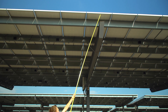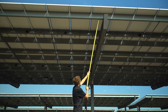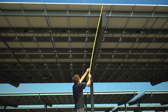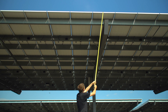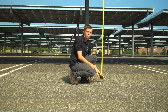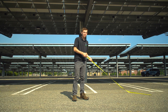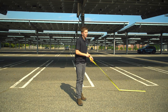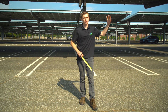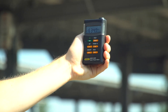Hopefully the tape measure doesn't bend midway through — and we got a little bit of wind up there. All right, coming down — looks like we're cruising at 16 feet. Now we can calculate our inspection altitude. There aren't drawings for this stuff that tell us the panel height; you just have to bring the tape measure out and check. It looks like we hit the 600 watts per meter squared mark, so let's get started and go fly.